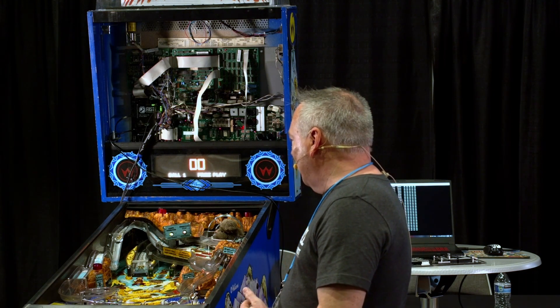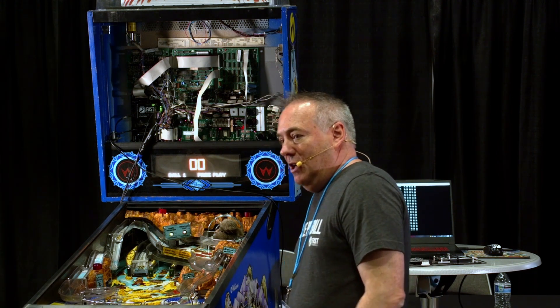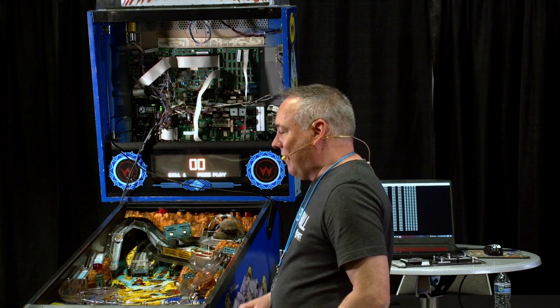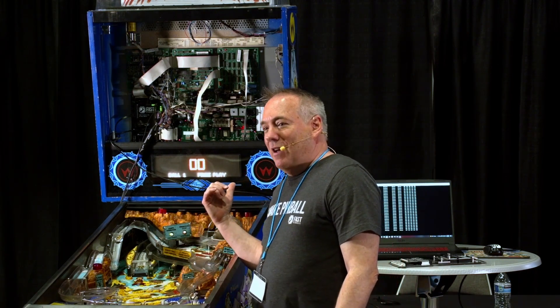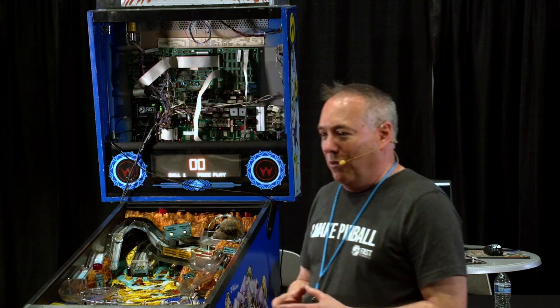All of that was typically built into the machine already. So if you're taking a regular machine and just throwing our board in and starting to use it, you do want to observe the rules the machine already had. You don't want to fire a coil that was supposed to be at 30 milliseconds at 40 milliseconds, because these machines — as old as they are — have a weak bridge rectifier. Start making things too hot and next thing you know the machine's not working.